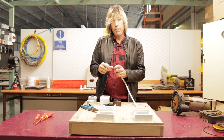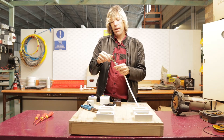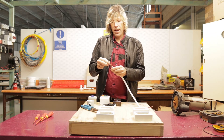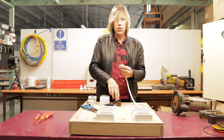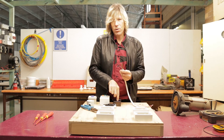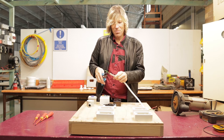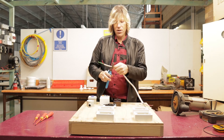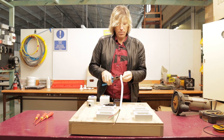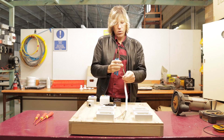When you are wiring into a board on a domestic dwelling in New South Wales, Australia, you will find your earth will actually get connected to the main earth cabling and it will be bonded — you will be soldering it on there. In commercial buildings and other states, you may also be connecting to an earth link or an earth bar. For today's example, I am going to connect it to an earth point, which is where the main earth would be connected. You will find that a lot of stuff goes to earth points, which are in turn all hooked up to earth stakes elsewhere — so it is still all correctly earthed.